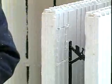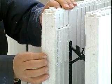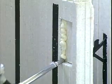Before placing concrete, cut an appropriately sized rectangle in the EPS and push it back just enough that there will be room for the fixture box in the finished concrete. Use spray foam to hold the cutout in place.